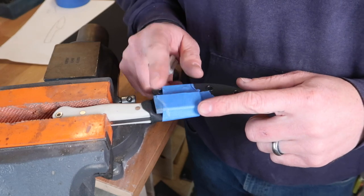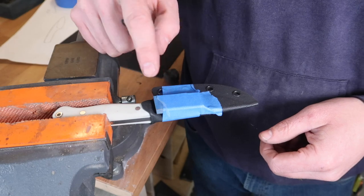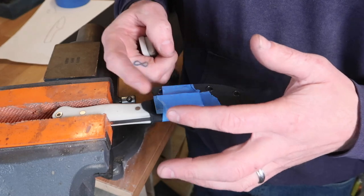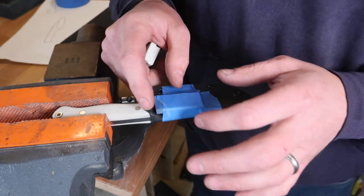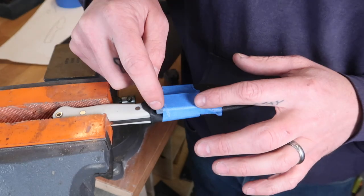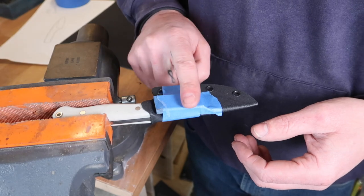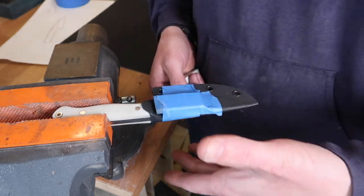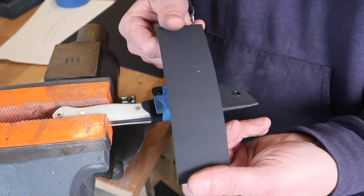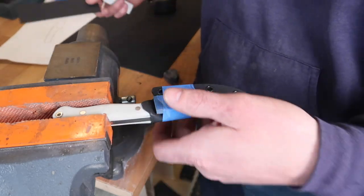So we've got our knife in the vise here, we've got the sheath on, and what's underneath this tape is just a piece of G10 — this is quarter inch. You can size it to suit your needs. I've squared this thing up so it's nice and even, it's a nice rectangular piece with the dimensions all the same, and then I've rounded these corners off. I did it on both sides. Then I just tape it in place here and we're going to take our warm strip of Kydex that we're going to use for the standoff and we can wrap this around when it's warm.